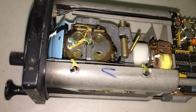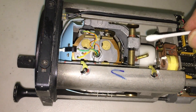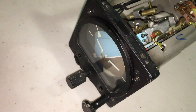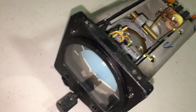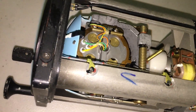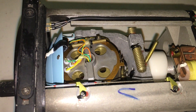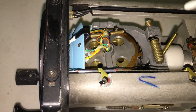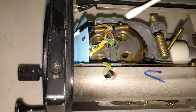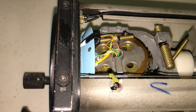I'll spin it up shortly so you can see that it is actually rotating. The unit is very finely balanced so that even when it's not powered it will fall to almost level. The reason for that is it will speed up the alignment process when you turn on the power — since the gyroscope is almost aligned with level, it won't take long for the correcting mechanisms to fine-tune back to true level. Even though this is an electric attitude indicator, it still uses a series of pendulous vanes and air pressure for correcting. The way it generates that air pressure is that the rotating mass has built-in impeller vanes that create airflow guided out through four ports.